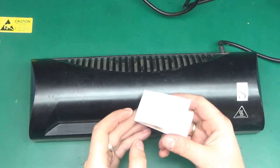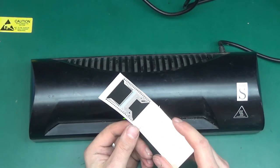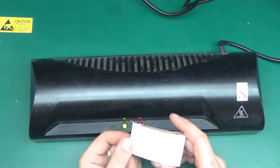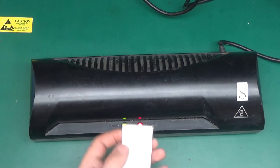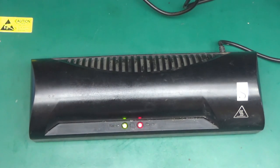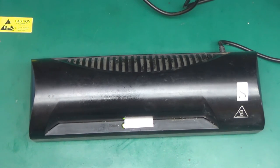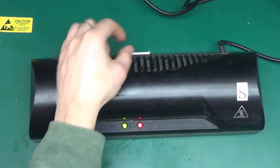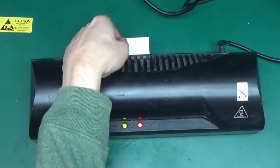The next one, fueled by curiosity — I'm just going to use the plain white paper that I printed. There's quite a lot of toner on here; let's see if that will transfer at all. I've cleaned the board with acetone from the previous attempt. After a few passes I'm also going to give it a little bit of water spray. I think that helps the toner separate from the paper. If just normal paper works I'll be amazed. I may have to soak it in some water.